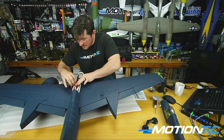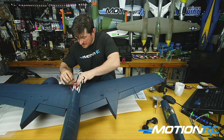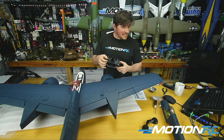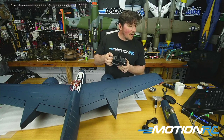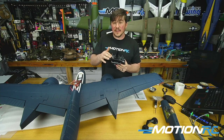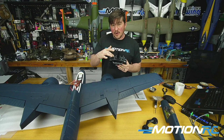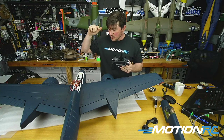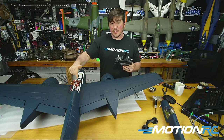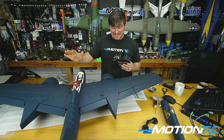Right there on the spot. Stay there. And then, actually, the other thing I can do. So one thing about the Admiral Stability Plus Gyro, you automatically get a remote master gain. It's on the knob. So I turn the knob all the way up. The knob all the way up is going to give you whatever your max on your potentiometers are that you set on the gyro. When it comes out, they are halved. So right now they're all at 50.